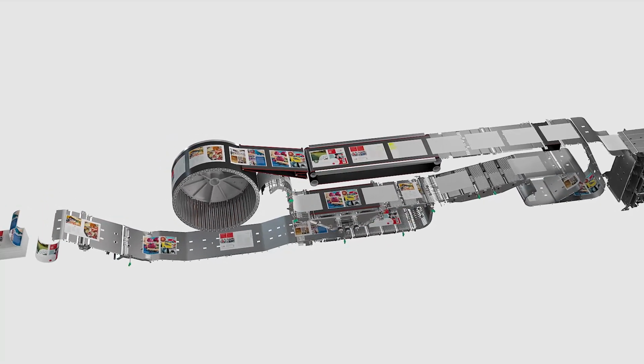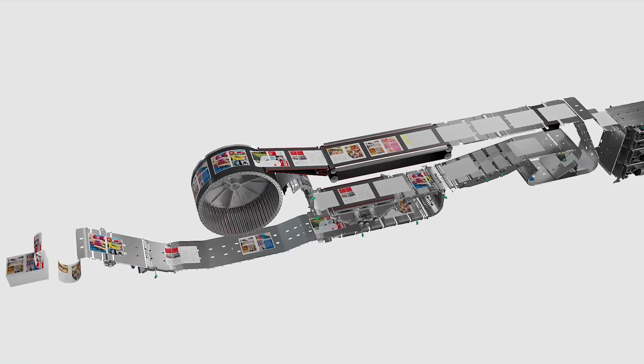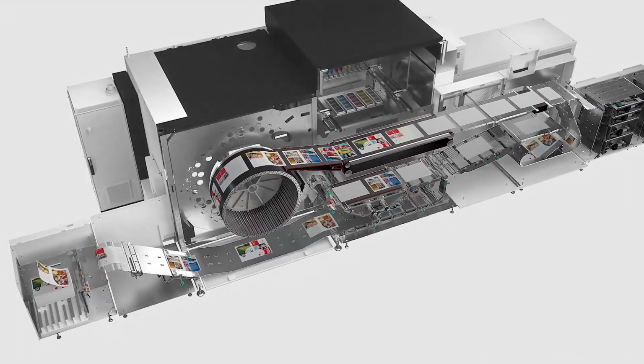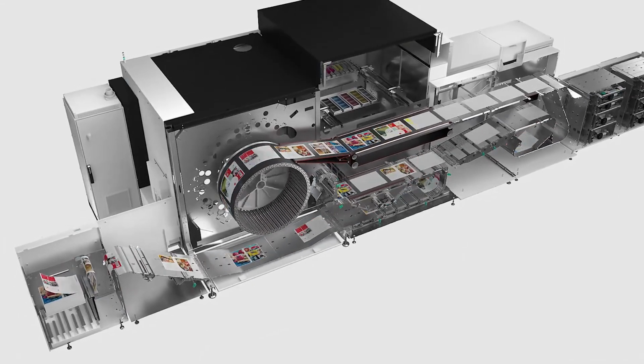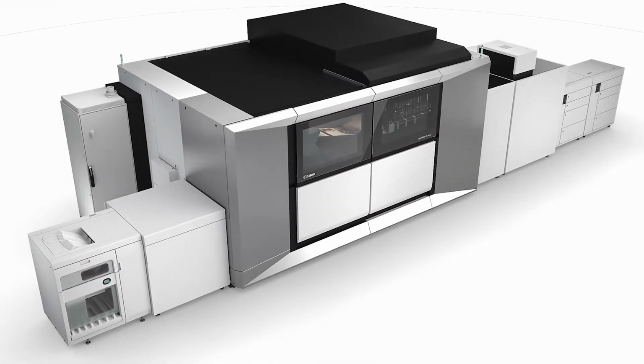At the next sensor, of which there are over 300, the state machine checks if the change has resulted in a change of timing. If not, it instigates another correction. The state machine also manages linking the image to the sheet. So once that sheet of paper enters the paper path, the state machine retrieves that image and sends it to the print heads. When the sheet reaches the start of the page position, the nozzles start to drop ink onto that sheet, and that starts the printing process.